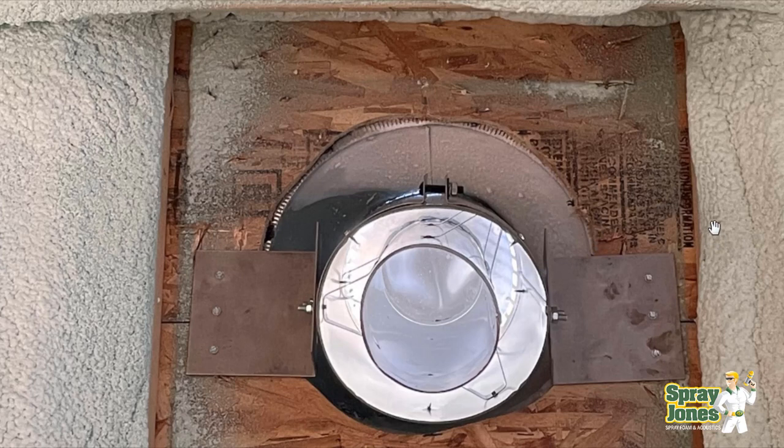This is going to be 10, 15, 20, 30, 40 feet — whatever height — through the roof from where your furnace or fireplace is. The big question is: when we're doing a spray foam closed cell non-vented roof deck, how do you get this sealed up? I get scared answers from the fireplace and gas people saying it's a heat-emitting device and you should stay a couple inches away. But we have spray foam to the underside of the roof deck — no venting, no air space — so how do you get the insulation close to the penetration?